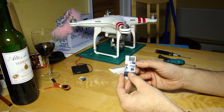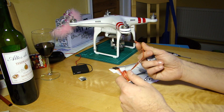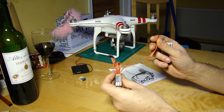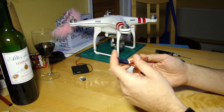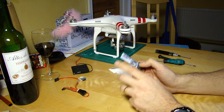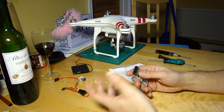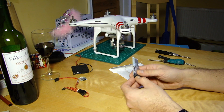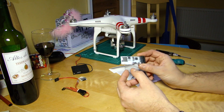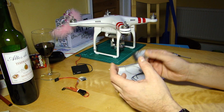It's a nifty circuit board with an SD card reader, barometer, thermometer and circuitry. It sat in-line with the GPS — you'd unplug your GPS, plug it into this, plug this back into the main board, and this piggybacked on the signals powered by the internal voltage. It intercepted the GPS signals, wrote them to the card, and when you got back you'd upload it to the Flytrex website, which would convert it into a nice overlay on Google Maps. You could download it as a CSV or Google Earth KML file.